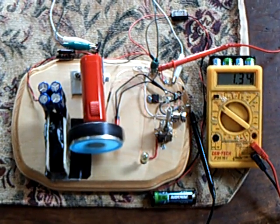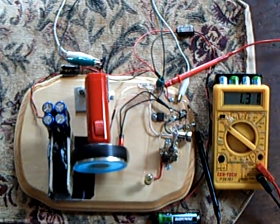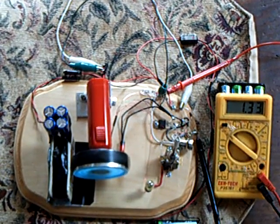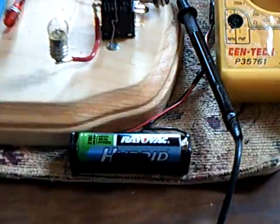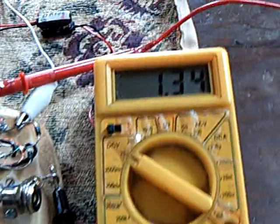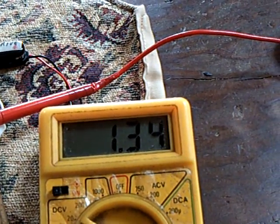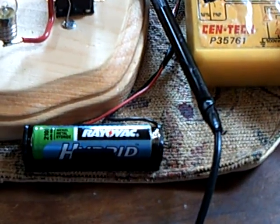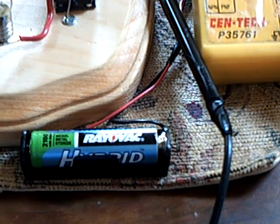Here's the latest experiment. It's the same motor that I showed before with the supercapacitors, only they're on the back side — they're on the receiving side of the situation. I'm driving the motor this time with one AA rechargeable battery that is supplying this with about 1.3 to 1.34 volts right now. These are a better scenario than the supercapacitors because they discharge at the same voltage for a long time.